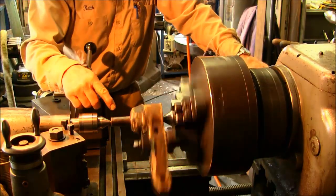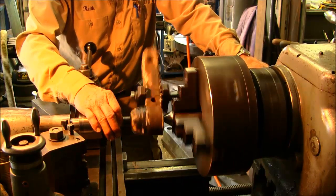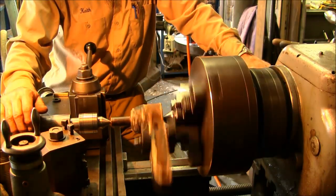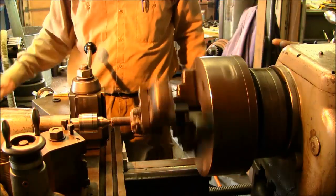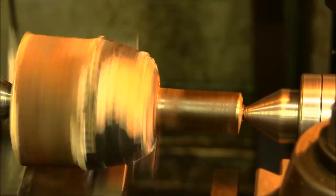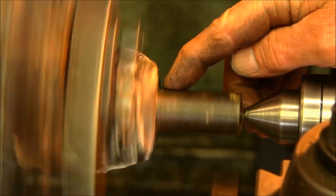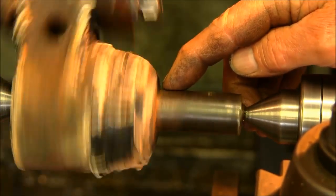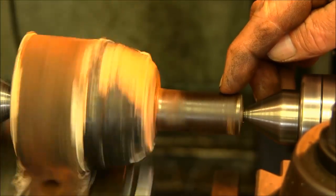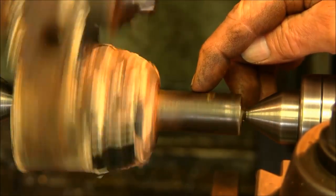Now we're going to bring you in close so that you can actually see the wear in the trunnion here. And in the center we are almost running perfectly true, and then you can see in here and out here a difference from over the years of sagging or spring. You know, the carriage is not riding exactly right, and the rust and corrosion. Okay, you can see it actually. You can see my finger going up and down right there, and also right there. It's more or less the rust wear on there, but now right here in the center, not as much. Very, very slight.